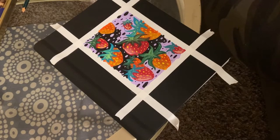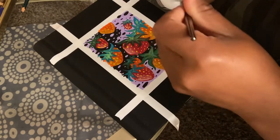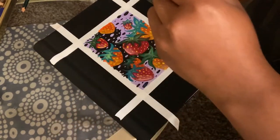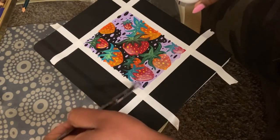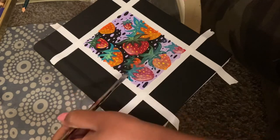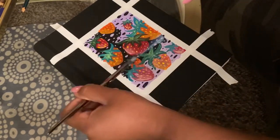I'm just going to coat it on there very nicely — okay, we got the bottle open. Just do nice, even coats. This finisher is like the consistency of water, it's super thin, so you want to make sure your underlying coat is completely dry or it will run. As you can see I'm coating it from top to bottom — I didn't speed this part up — and it really only took about two minutes to do probably two layers over the whole thing.